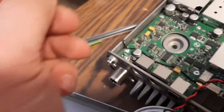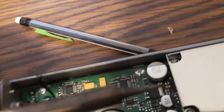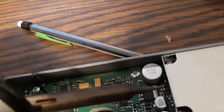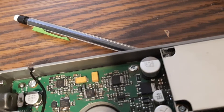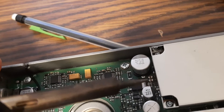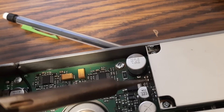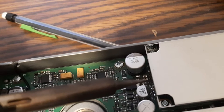You're going to want to angle the iron — you're sitting about here. I'm left-handed, so if you're right-handed you'll go the other way. With the other hand I'm going to feed solder. I'm going to heat it up and add it here, heat that up and add it there, then come back and carry that puddle and add solder — and boom, the gap is bridged. Then I'm going to take a breath, because this is stressful — this is somebody else's radio. Then I come back and do the same thing: add solder to this one, come over here, add solder to this one. As I move back I don't pull out of the puddle — I try to drag that solder. As I move the iron back and start melting the closest pad, I'm adding solder to the iron and it flows from the iron to the two pads and bridges the gap.